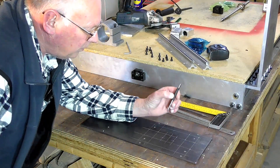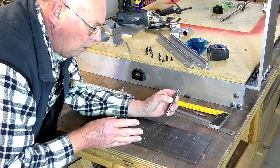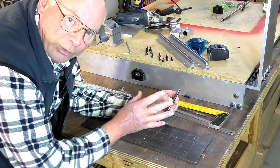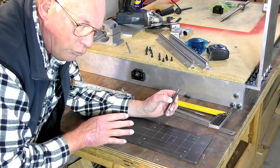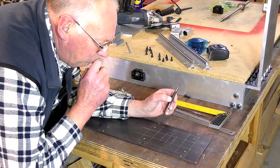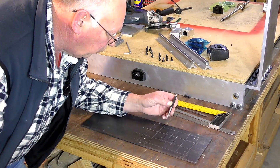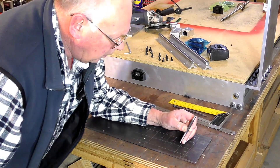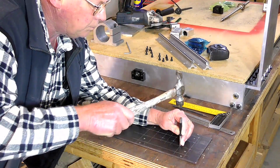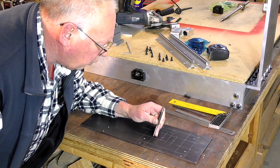This mounting plate is the Z-axis mounting plate, but it is also the X-axis carriage plate as well. It is the most complex part of the whole build. So you've really got to make sure you get this one right. It's full of holes as you can see. I'm just centre marking. It's very crucial you get this one right.